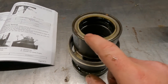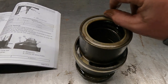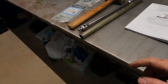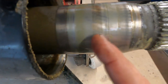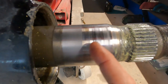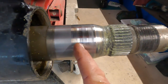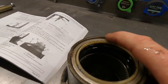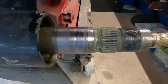I'm going to make note of where the seal is right now — the outer seal is just below flush of the case. Sometimes where the seal rides on a shaft you'll see score lines, which you can feel with your fingernail. You may want to cheat the seal into a different position so it doesn't ride in those same grooves — instead of below flush, set it just flush so it has a nice fresh surface to ride on.